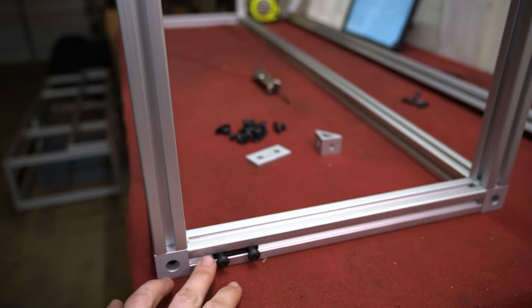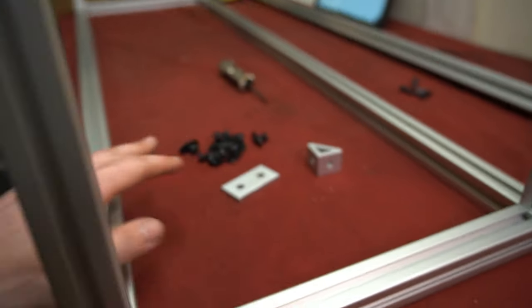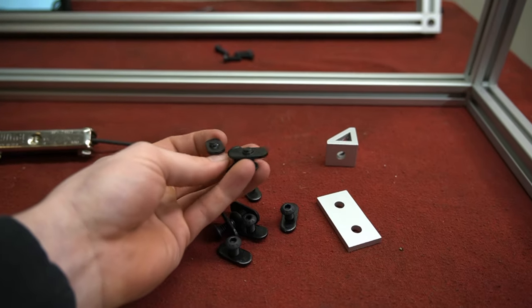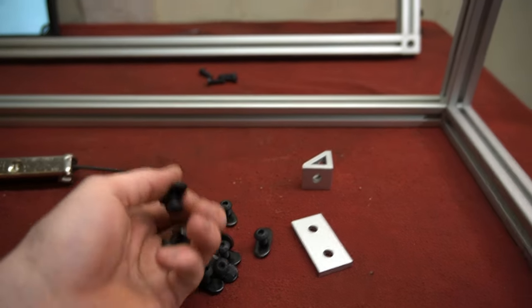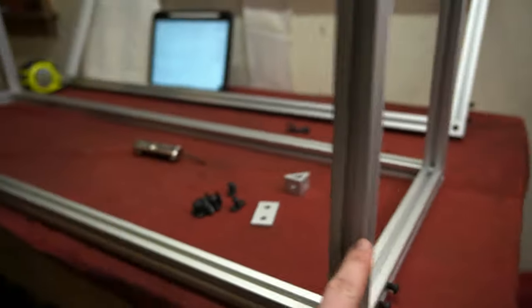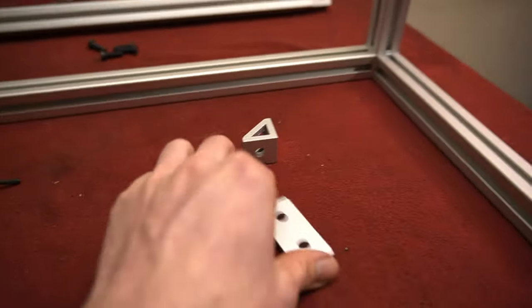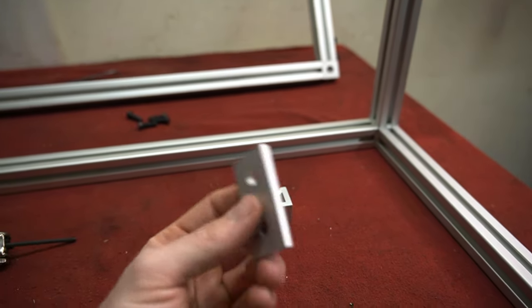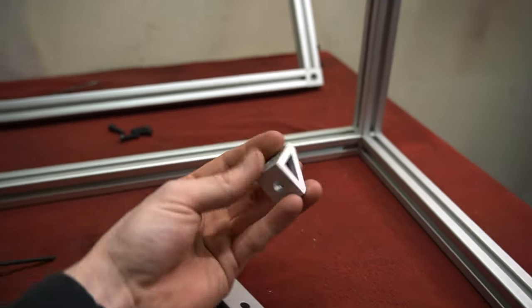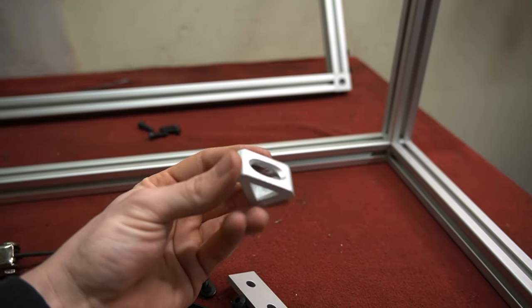Just like we did when we put these plates in here to prepare for the future when we mount those side plates, you're gonna wanna go ahead and drop in 2 on the top and 2 on the bottom on each one of these, so on the outside. So there's gonna be 2 on this outside face, 2 on this outside face, and then same for that side. And we're doing that because our sliding drawer module, these are gonna be what attach the main module to that. And then these are gonna be used at the very end as anchor points to secure it to the truck itself.